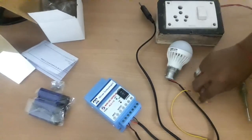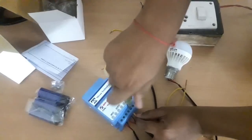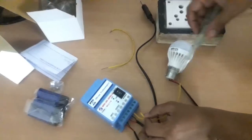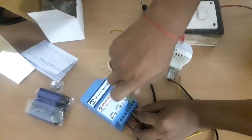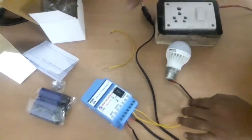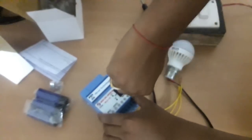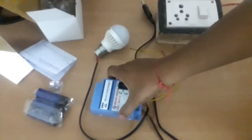Now I am going to connect the three sensor terminals: G, OL, and OH. Basically you have to connect the three sensors there, but for testing purposes I am just going to connect three pieces of wire at the G, OL, and OH terminals. I have connected the G terminal and the OL terminal. The controller works based on conductivity — so I am just checking the conductivity; if the conductivity check passes, the controller is working.